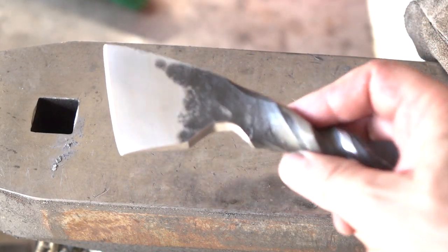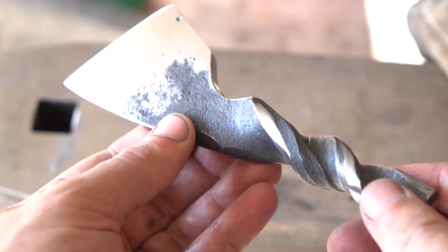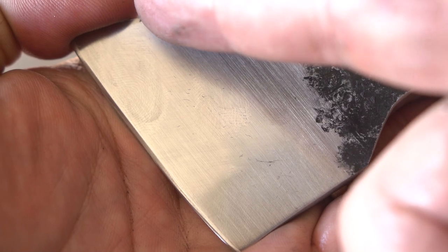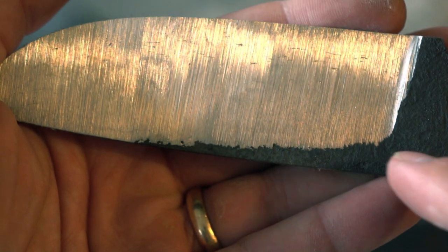But what bothers me the most and what makes this piece ultimately decorative and not usable is this. I made a kiridashi out of the tip. It's not an especially awesome kiridashi, so go easy. But you can see halfway through the steel, when you grind down, there's these lines, and they're sort of oriented perpendicular. They're lines and voids. And I heat treated before I ground.